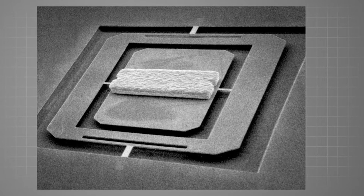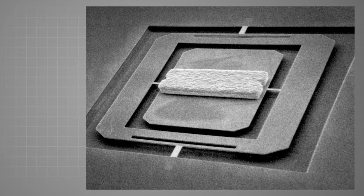MEMS was a new field back then — not much had been done beyond pressure sensors. Paul thought, if the fly can do that, we ought to be able to do it on a silicon chip. Burt had the idea of making a very small gyroscope out of silicon and asked his colleague Paul Greif, who worked in the very large scale integration lab, to fabricate what Burt had designed: a double gimbal gyroscope. One piece of silicon is driven to vibrate, and when experiencing a rotation rate, the other piece on a different gimbal starts to vibrate — that is the output.